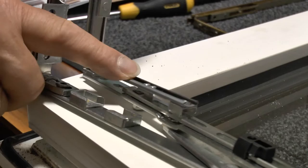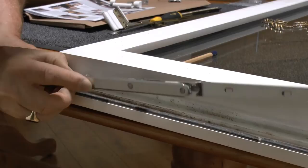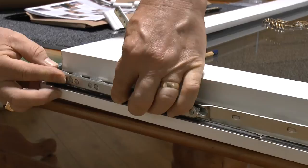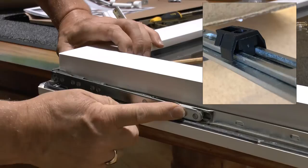Right, we can now offer the two parts together into the euro groove, back first, then slide down, checking that the points where the latch together are still maintained. They go together and there is a slight click as you push them in — there is a plastic connector that helps locate it. Push them in, and now we try to get the two sets of teeth to latch together. It can sometimes be a little bit difficult with this last one, so you may need to use something like a light hammer just to tap it in.